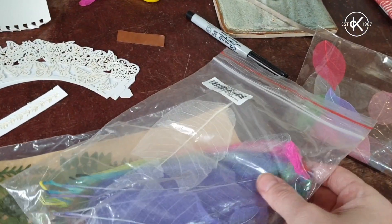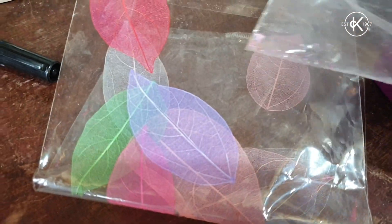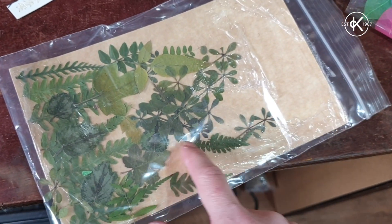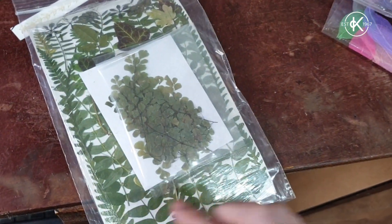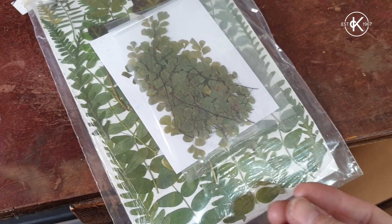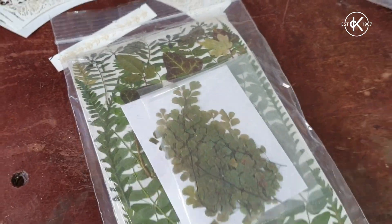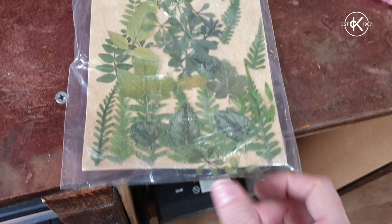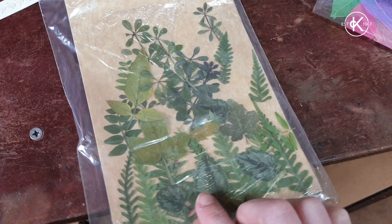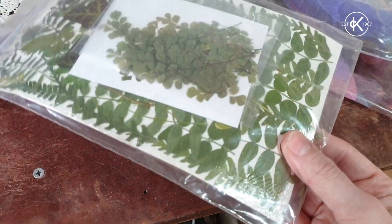You need to make sure your metal is not rock solid before you do this. Skeleton leaves are really popular and come in different sizes — the color doesn't matter, it's about how well defined the veins are. You can also use real leaves from the garden, but they're far too soft and full of moisture — if you put them through the roller they'll squelch everywhere and could leave your rollers rusty. Pressed, dried leaves for card making are much better: they're flexible but have no wet organic material left in them and give a really nice imprint.